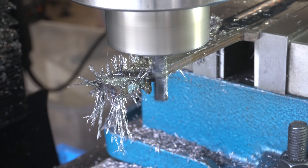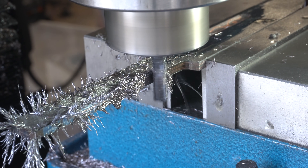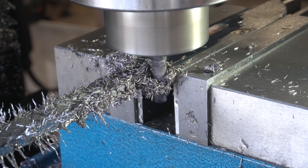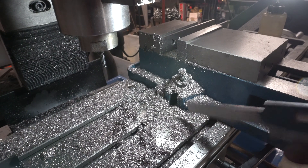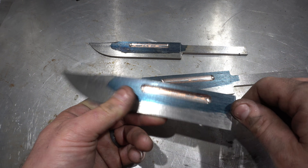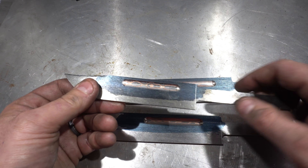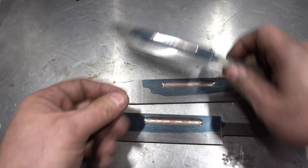Now I'm using a quarter inch end mill just to do the tang. I think it's cool the way the chips are all magnetic and have stuck to the tang. So after about two hours I'm finally done with all that mill work. I've got the fullers all milled — I think they look really good. Very little chatter, so they're nice and smooth, and you can actually see how centered the billet is if you see roughly the same amount of copper coming through on each side.